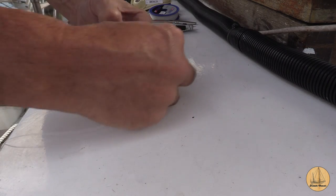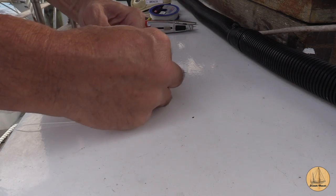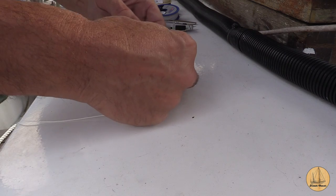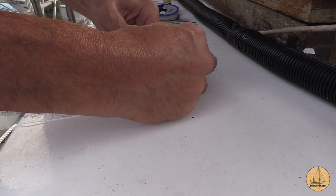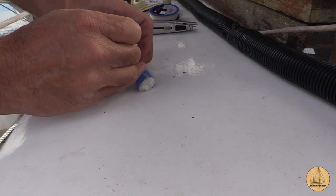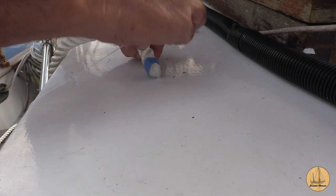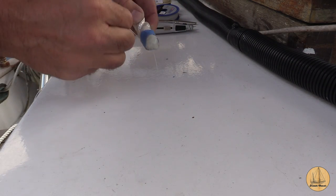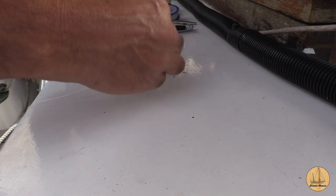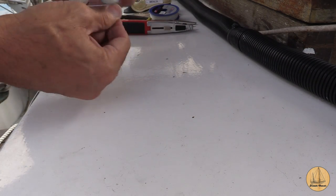This isn't the easiest thing, so you want to really get this started. I'm going to do a couple of tight loops, and then I'm just going to keep running upward toward the loop end, keeping it as tight as possible — you want a good strong fit. Because it's three-strand line, it's not quite as easy to get started as a double braid would be. A lot of people like to have an alternating color for the whipping, which I agree makes it easy to see, but this is going to be in the anchor locker so I'm more worried about functionality — and honestly, just to practice.